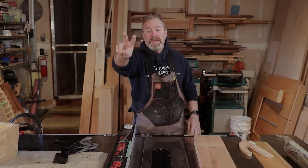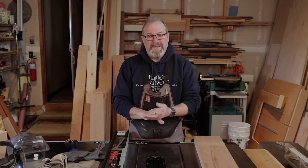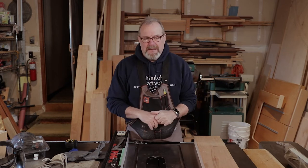There you go. All right, number two. No loose clothing, long hair, dangly jewelry. Get rid of it. Even sometimes rings. I've seen somebody get their hand smashed from a kickback with a ring on it, and the ring smashed the crap out of the guy's finger. And that was no good.